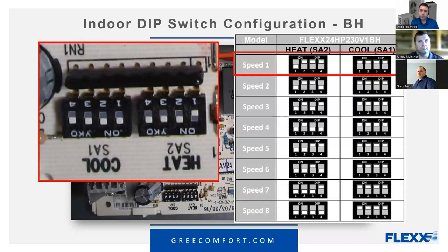On the BH revision terminal board, they took away the Y so you just wire-nut the Y together by itself inside the air handler when running your low voltage. They repurposed that terminal as D, which stands for defrost. The outdoor unit has a D terminal as well — when it goes into defrost, it can send a signal to the indoor unit so the indoor knows the outdoor is in defrost mode.